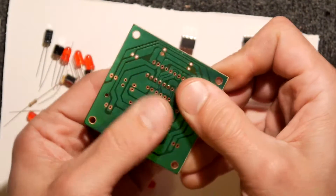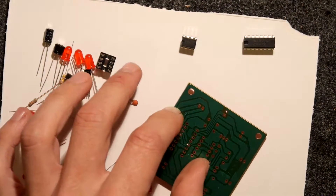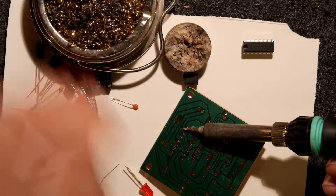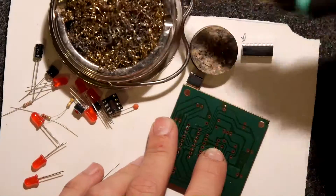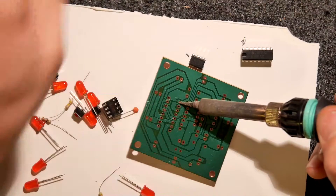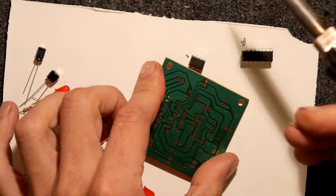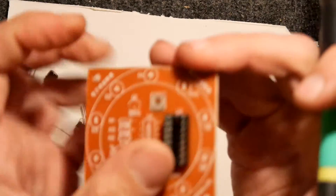If you have some flux use it, but I don't have any right now. I'm going to take my solder and iron - I've got it quite hot. I haven't cleaned it for a while so I'm using some solder tip cleaner, which is just a horrible nasty flux, and then this weird Brillo pad thing to clean it - get them on eBay, they don't cost anything. What I like to do is get your first pin on - that christens the board - then go straight for the opposite end.